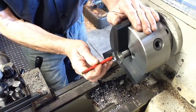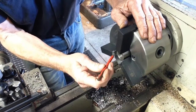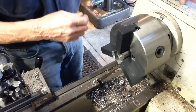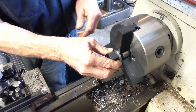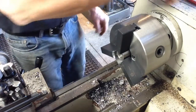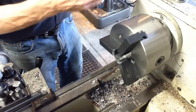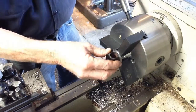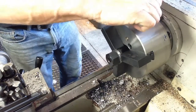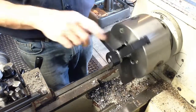And also on that final cut, once I did bring the tool in a bit, so we did undercut the very back of it, so our part can sit in on a square corner. So that should be pretty well sized for that, which it is. So take our clamping piece out. And it's a matter of just put our part in. And that will hold that dead true.